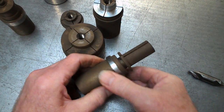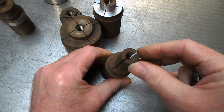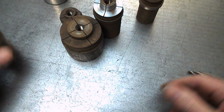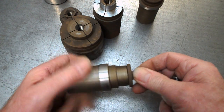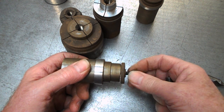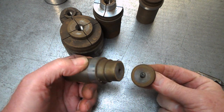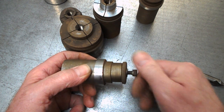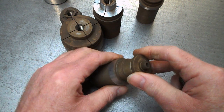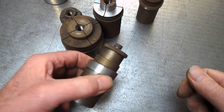I've got another one here - it's obviously taking a longer piece, and this has just got one split down the length. And of course another way of doing it would be not to split it, but to have just a fat washer on the end. If you've just got a ring, a thin-wall piece of tube, a short piece of tube that you just want to skim the OD on - stick it on there and clamp that up. Pretty rough old things, but you don't want to spend time making these things look pretty. They just need to do the job.